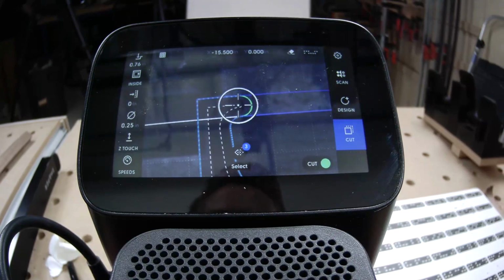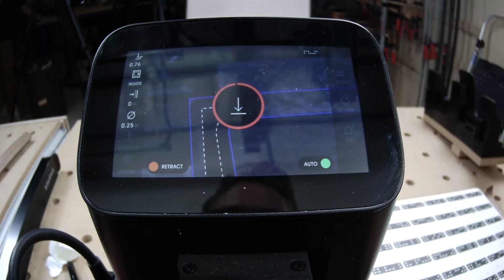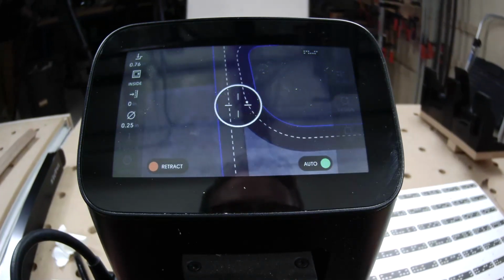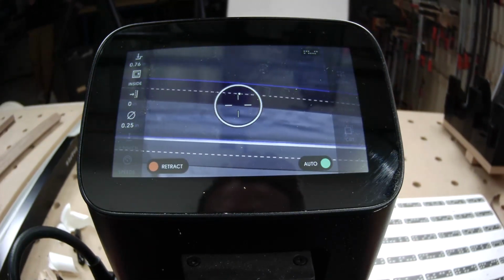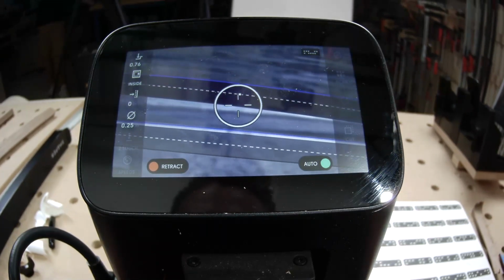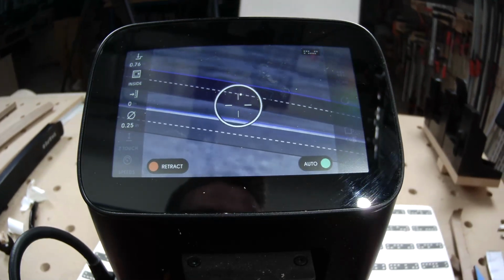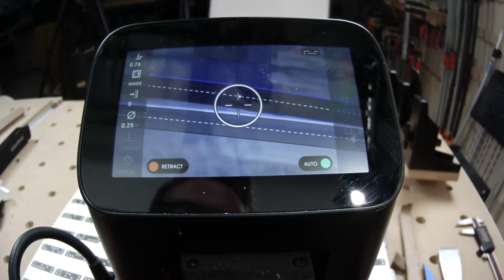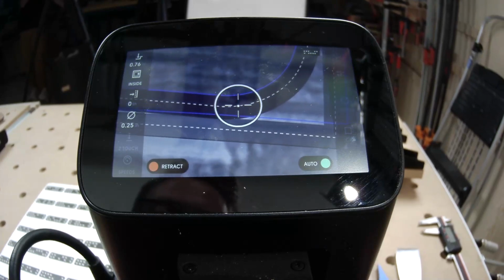So one thing he just did also was remove some of the scrap from that roughing pass too. You always want to get rid of any loose material in your workspace so that there's no chance of that router bit coming in and catching anything that you don't want it to. You want to cut the workpiece, and the workpiece only. You don't want to get any scrap caught between the router bit and your workpiece. That's asking for a bad time. Nice smooth finishing pass here. Origin keeping everything right on the line.